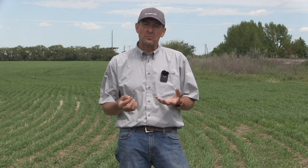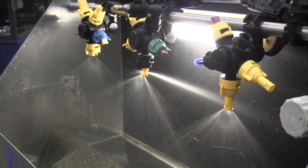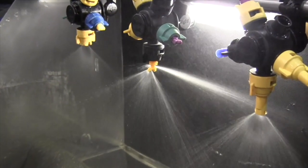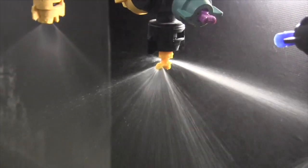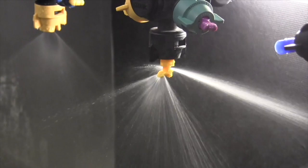When you're looking at numbers of nozzles throughout the season, people are often asking should we have two, three, or four? Most of my customers really have three nozzles, and they're really selected for water volume. They'll have a five-gallon tip for burn-off, a 10-gallon tip for in-crop, and maybe a 15 or so-gallon tip for their late-season sprays — fungicides, desiccants, and those kinds of things. An additional level of options might be to have a low-drift version of each of those, so that if conditions require it, you can still go out and spray.